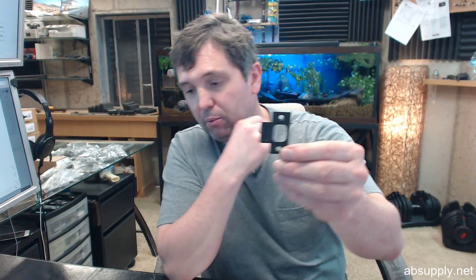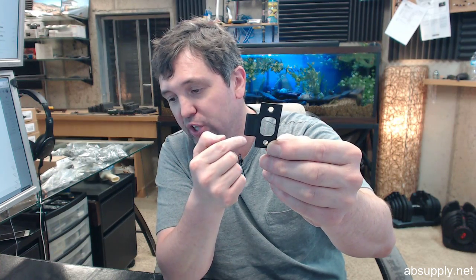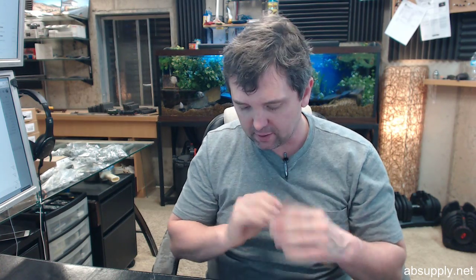This strike plate preparation: install the strike, drill a 3/4 inch diameter hole, 1/2 inch deep in the door jamb opposite the center of the door latch, and then mortise a 1/16 of an inch for that. You're going to eyeball that sort of installation. Mark where the latch bolt falls onto the jamb, and then mark your holes and mortise and drill.